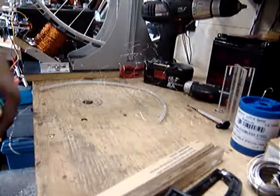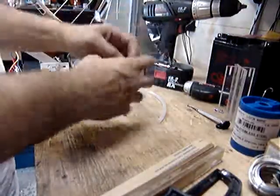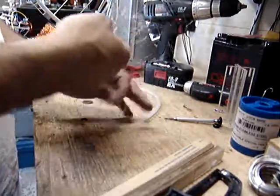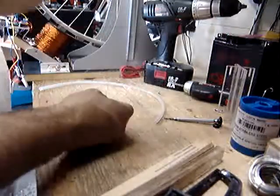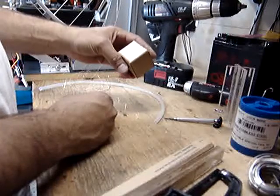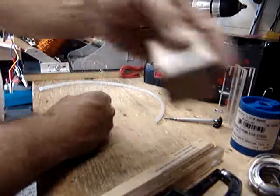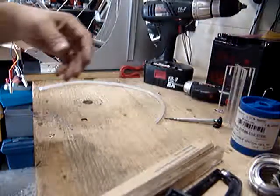Welcome back. Last time, if any of you saw it, we had the last little prototype electrolyzer built with wire in the jar. Unfortunately I thought I was using stainless steel surgical wire, but if you read the box carefully, it just says surgical corrosion resisting steel — does not say stainless steel. So it helps if you read. We're going to toss that aside and get rid of this bundle of wire because the electrolyzer ate right through it.